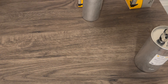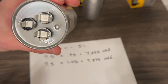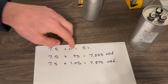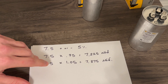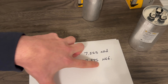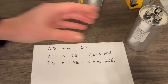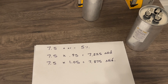Switching over to the 7.5 side — same example, the 60 by 7.5, plus or minus 5% — for the 7.5 side that operates the top fan for the condenser fan motors. When we test this for the range, 7.5 times 0.95 gives us 7.125 microfarad on the low side. And on the high side, 7.5 times 1.05 is 7.875 microfarad. So when we test between common and fan, we should get somewhere between 7.125 and 7.875 to be considered within manufacturer specs.